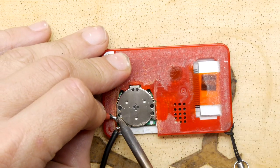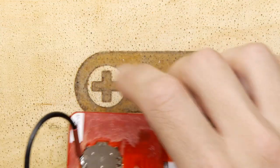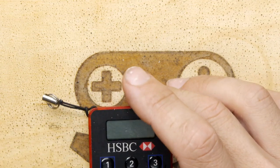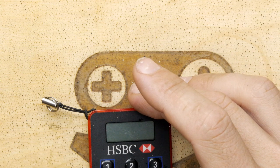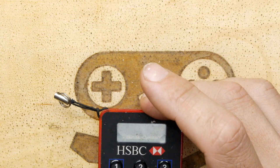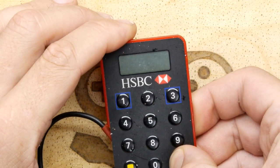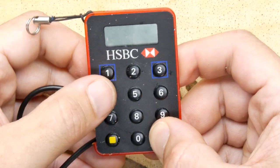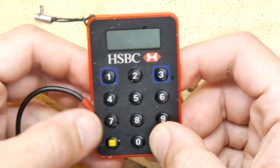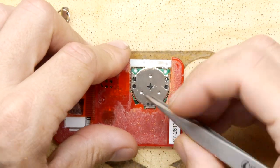Soldering on the wires - positive on last. This is very heavy wiring for this moment of truth. Turning it over to the bench power supply, adjusting to three volts - let's call it 2.9. Flicking it on - power is on. It certainly appears not to be drawing any current whatsoever. Okay, I think we're going to stage two now where we just yank the battery and see what happens, and figure out how it's all plumbed in.